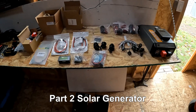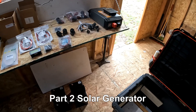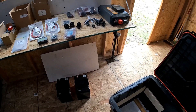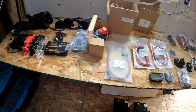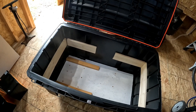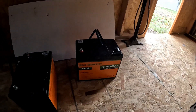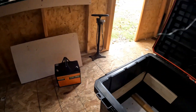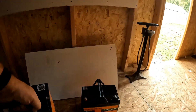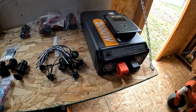Alright, fans — Farm Life. I'm going to lay out what's going into this solar generator. I've watched a ton of videos and everybody gets all this stuff crammed into a box about half this size — that's not going to be me. My batteries are these Eco-Worthy 100 amp-hour batteries. I'm going to put two of them in parallel, so that'll give me 200 amp hours, and I've got a 2000-watt inverter.